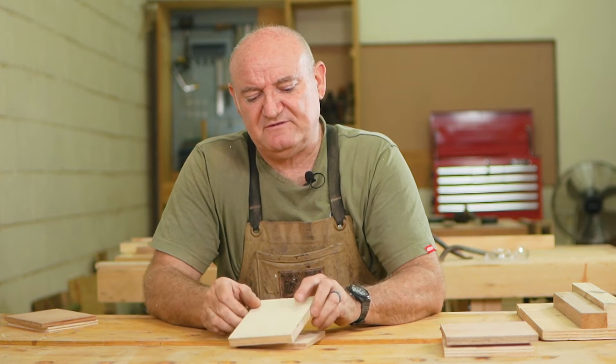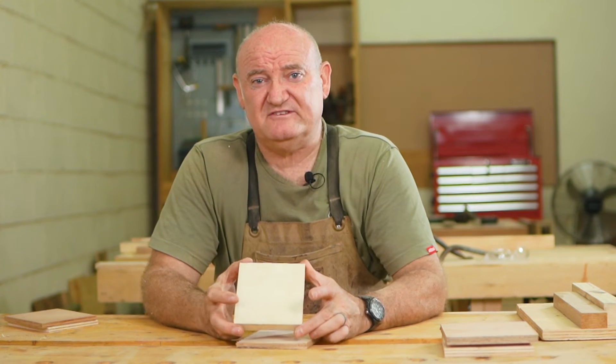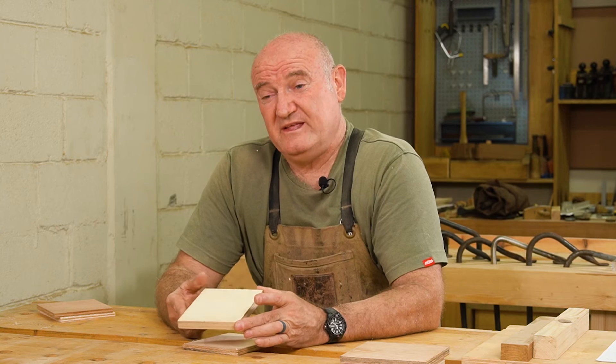This stuff is not cheap — you may as well get the good stuff. Within birch ply there are grades just like every other plywood. SBB is the top of the pops — the best one you can buy. SBB is furniture grade ply: great on both sides, sands well, incredibly stable — that's quite a big deal especially for furniture. It absorbs finish well, you can shape it, router it, do amazing things with it. In many instances it's as good as solid wood, but has the advantage of being stable.